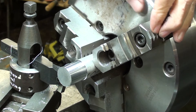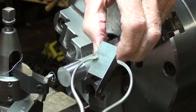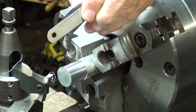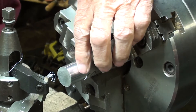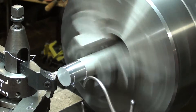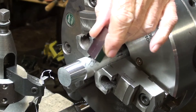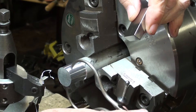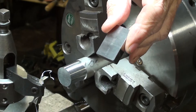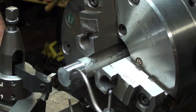Now I'm going to use the 900 thousandths gauge block and see how close I can get it to 900 thousandths. Here's the 900 thousandths gauge block, along with the 10 thousandths, so my caliper is set for 910 — nine hundred and ten. I'm going to do that off-camera and we'll see what we come up with. I'll take several passes as I did on the previous one. Okay, I'm at 910. I feel that I'm at 910 according to the caliper. Now I will reset the caliper for 900 using this gauge, and I'm going to work up to it, taking short trial cuts and measuring.